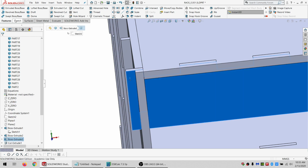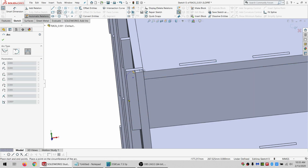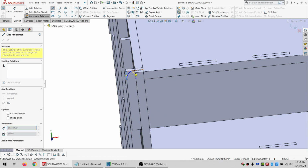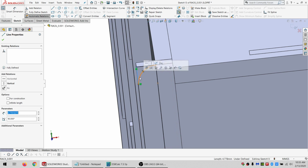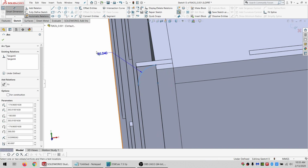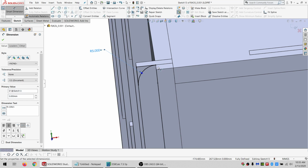I would like, however, just out of vanity, if you will, I'm gonna just put a fillet up here, and the reason I'm not using a fillet tool is that you can only do it on one body at a time. And this cut I can apply to all the bodies at once, and I want it to be 5, so it'll be right on there.